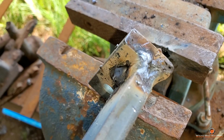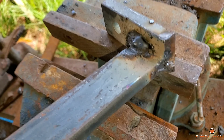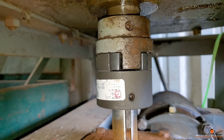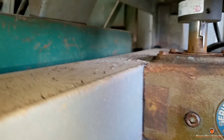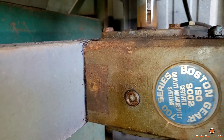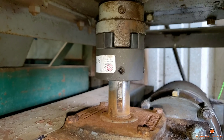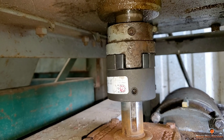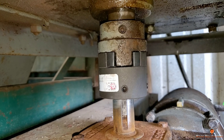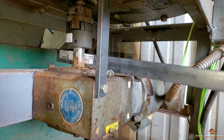We're fixing to go to a 4th of July celebration and I don't want to leave this place unattended after welding on something that oily. Jim Bollinger, eat your heart out — that'll be an Instagram prize-winning photo there for sure. Got her up there, got it anchored, coupling's looking good. We've got some stability on the right side along with the left side with in and out, because that's a piece of angle — that will make this a lot more rigid, less rinky-dink for sure. All I've got to do is jam that coupling up tight, snug up the set screws, and we are ready to run this thing.